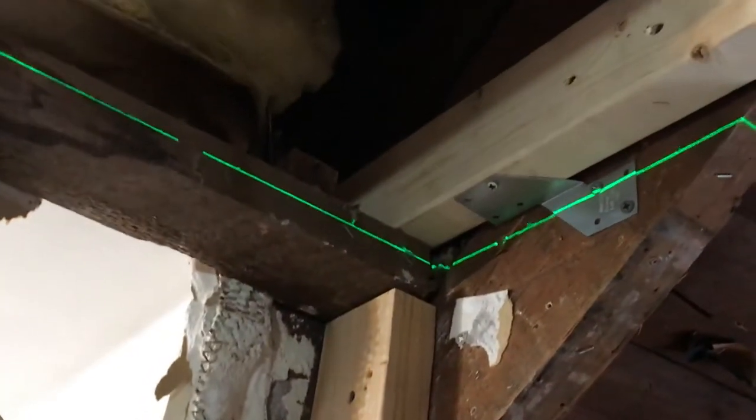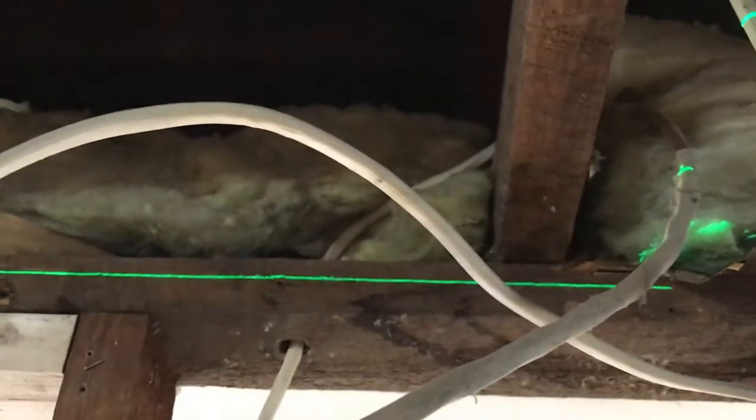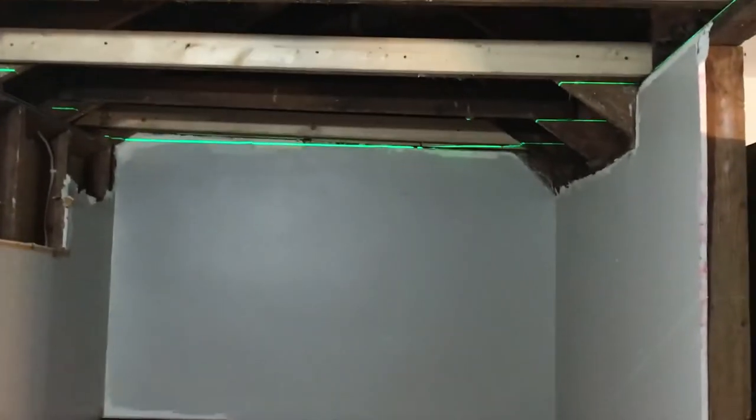This new one right here I just have to drop it a little bit. This one I can notch — take that joist hanger or rafter tie off. This original one has to be dropped a little bit; I might scab another two by four on here to get it level. This one right here — that's about it for now, I hope you like it.